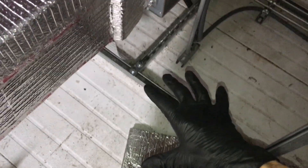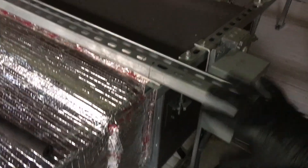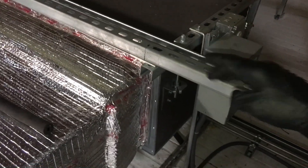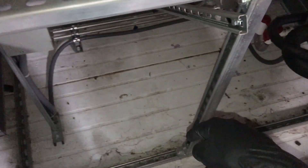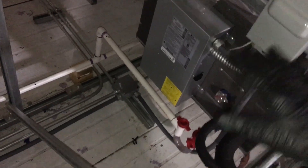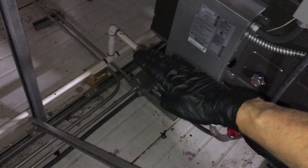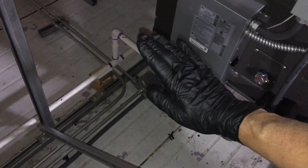I was thinking: super negative pressure in here, plugged filters, maybe the tilt — because we're on a foam roof that's over a foot thick, and it did tilt a little bit. We had to go around a second time and readjust everything because there was settlement of the roof after installation. The roof settled so much — there are big iron beams, six by six beams below here holding up both sides — but the compression of the weight squeezing the styrofoam meant this half went down enough that it started tilting back the other way and the units were filling up.